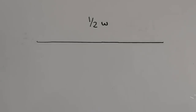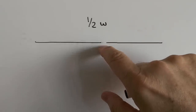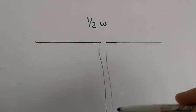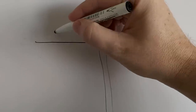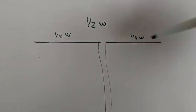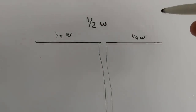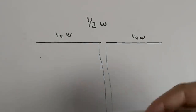There are antenna configurations that are more prone to stray RF current, but we'll start with one that isn't, and that's the regular dipole. A dipole is a half-wave wire fed in the middle, so you have your feed line — coax or ladder line — feeding the antenna in the middle. The two sides are each a quarter wave at the same length, so there is no current imbalance between the two sides. The power will be radiated gracefully and there won't be any stray RF currents coming back on your feed line, like on the shield of your coax.